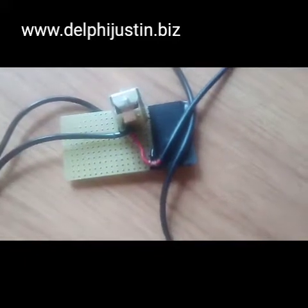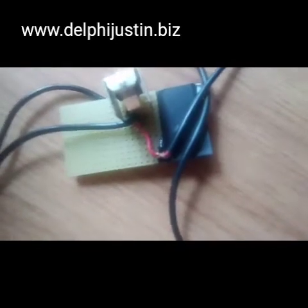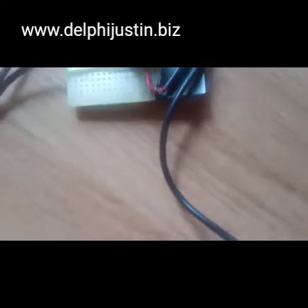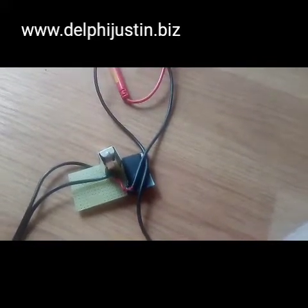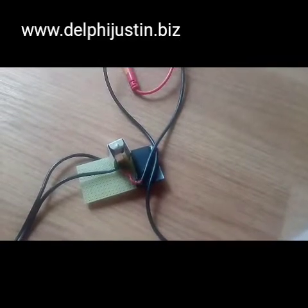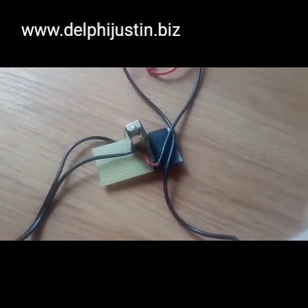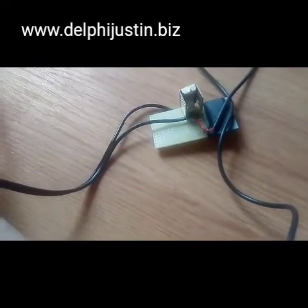I believe the only reason they did this was because the battery charging circuit itself couldn't run on 12, so they want it on 9. They probably have a circuit in there, either a comparator or analog to digital converter, that reads the voltage going into it before it goes anywhere else and checks to see if it's greater than a certain point. If it is, then it sends it to that area. Otherwise, it turns off the charger part or something like that. It probably goes to the battery, but it's probably only like a nanosecond long, so it doesn't harm it.